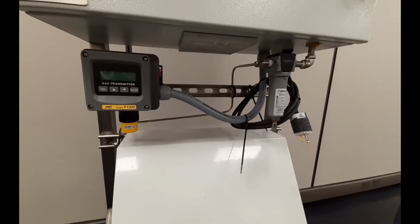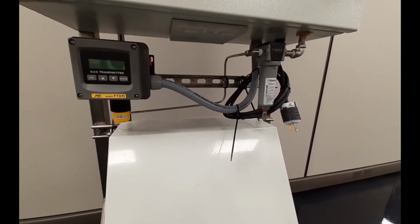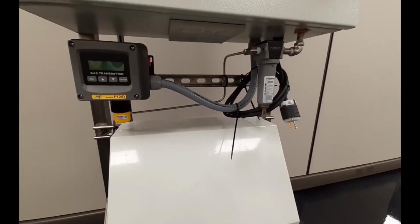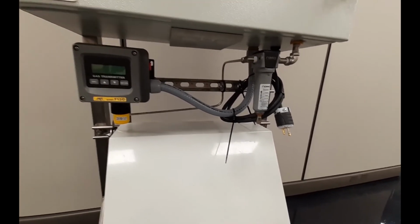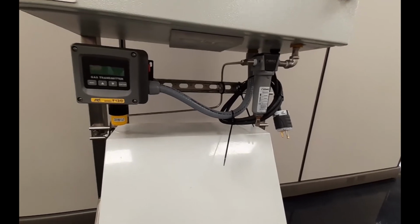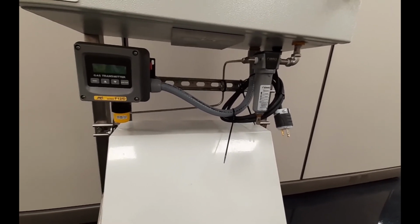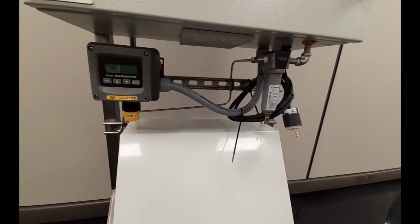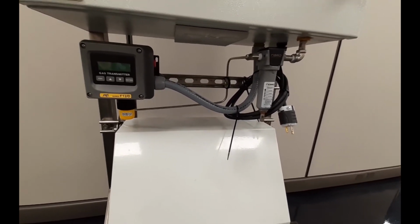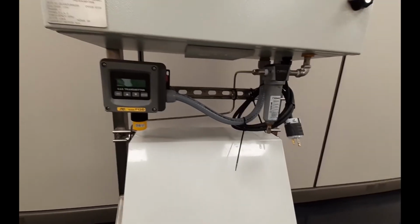This particular system is equipped with an ATI F12D series gas detector with ambient ozone sensor. The gas detector has been set up to alarm and shut down ozone production when it senses ambient ozone levels above safety levels for a 10-second duration. The gas detector will not allow the system to reset automatically. The operator will have to intervene. In order to reset, the ambient ozone level has to be at 0.0 parts per million, and that level must be sustained for at least 10 seconds.